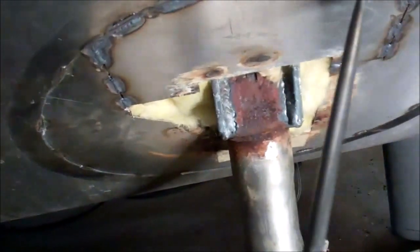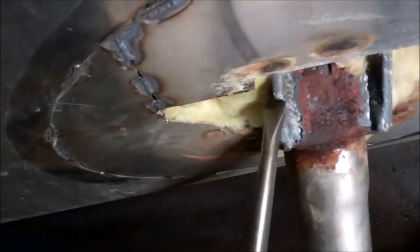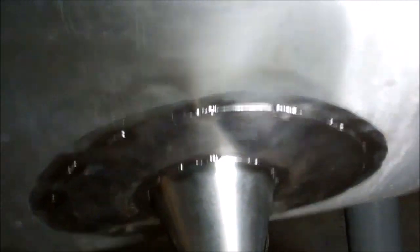So now I've got to put these stainless steel panels back. I'll put some fiberglass insulation in there and then weld this piece back in. I've welded that section in. Now I've got to put those panels on — they're only stitch welded. I've had to cut a little piece out of there to clear this frame. Got those panels welded on, polished the welds. I'll be back tomorrow to repair the other side.